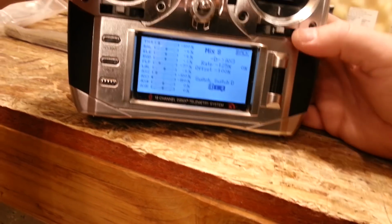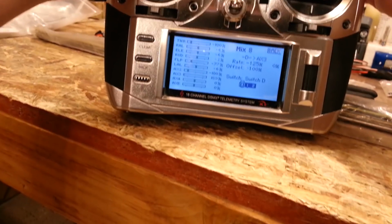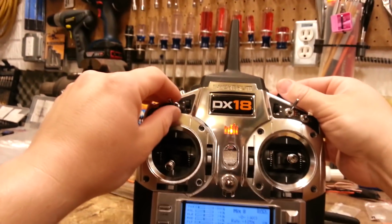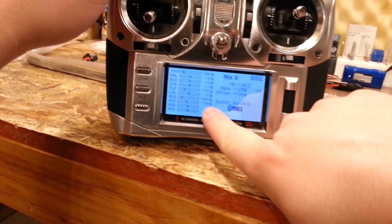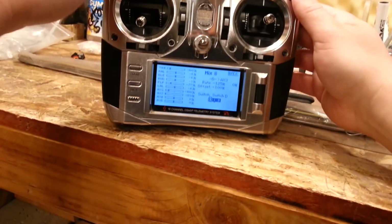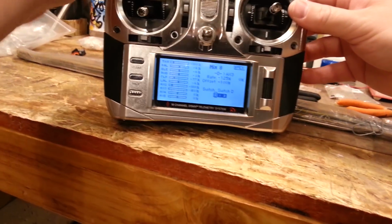Okay? See this? It goes from whatever we have it set to. See, it's at 108. Goes to off. Goes to off. So that mimics my normal mode of operation. So that when I fly this plane, say I've got the stabilizer set to like minus 30 for my normal, like really small amount of stabilization. Off. Off. Let's say I have it all the way up for some weird reason. Off. Off. No matter what.